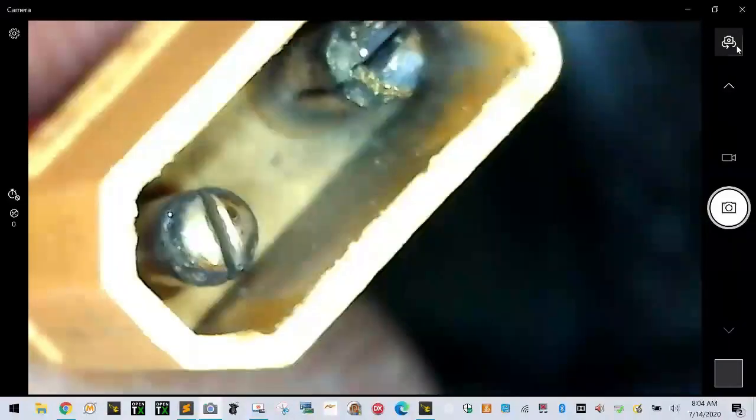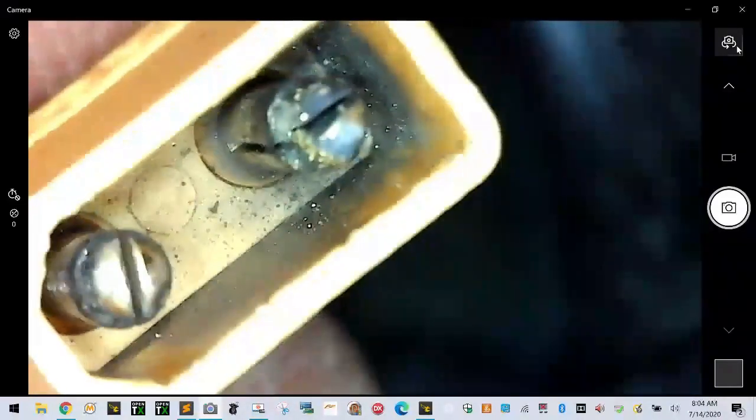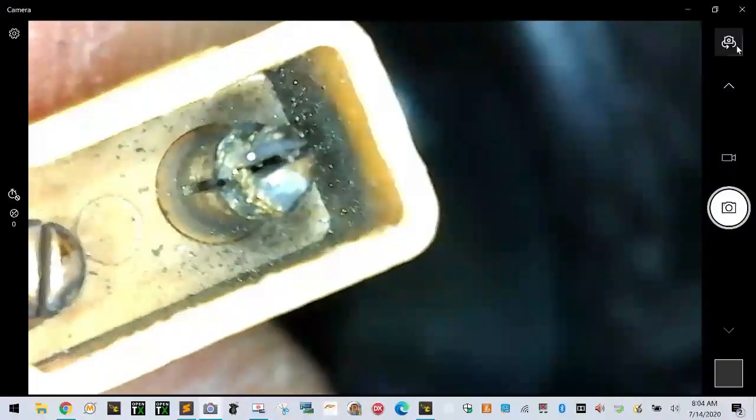See, this is the positive lead right here, okay? And boy, I tell you what, that touches right there and grounds this out. If it makes contact and there's grounding, you're going to blow this cap and probably fry your stuff. Now, I'm curious if the XT30 looks burned inside. Let me see. It has definitely had some issues. Okay, so there's definitely some problems here.